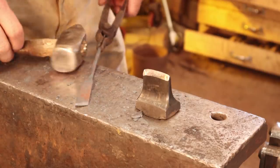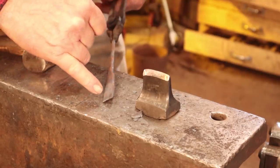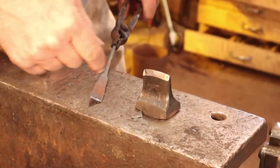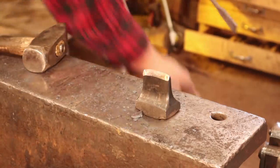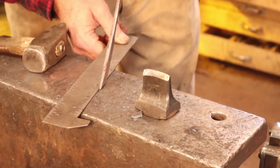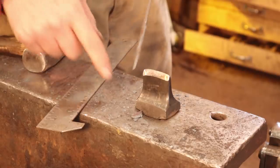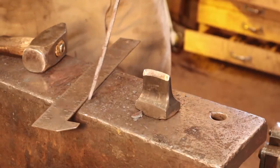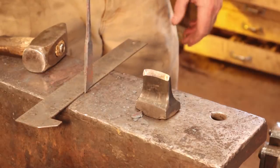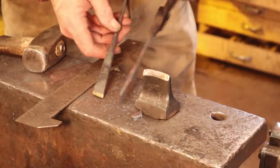Now let's look at the one we just did. The flat side of the blade is on the right hand side of the knife; the bevel is on the left hand side. In use, these are generally run down a square, straight up and down, with the good side under the square. The waste is on the bevel side where the knife is. So as you cut like that, this knife works best on the left side, and on the right side you would want one that's the exact opposite.